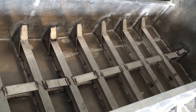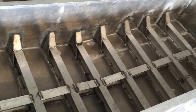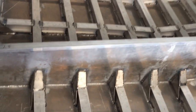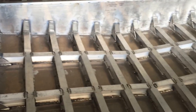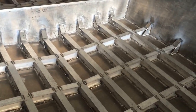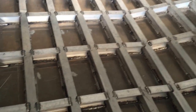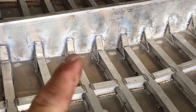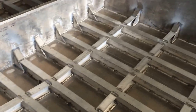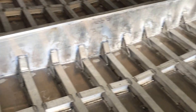There's the I-beam all the way across and the triangular-shaped gussets — I just love this I-beam material. It's three inches wide and four inches tall, and on a boat this big it's probably by far the best stiffener you could use on the bottom. It looks really professional and lays down nice. If you go to the extreme of adding those triangular gussets everywhere it meets, it doesn't get much better than that.